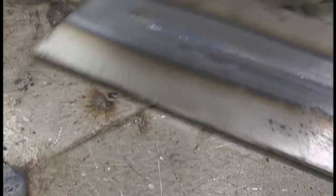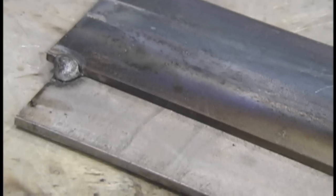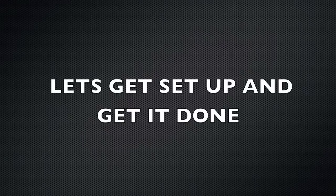I'm using only eighth inch thick here — that's about as thin as you'd want to go using stick welding — and welding it from both sides. It works out about right at that thickness as long as you don't set the machine too hot. Then a T-joint welded from both sides, and after the T-joint is a lap joint tacked up and welded both sides again. These are all basic joints that you would do progressing along in any welding school. You won't obtain full proficiency with the merit badge program, but it gets a really good start to welding for a scout.